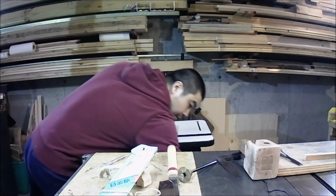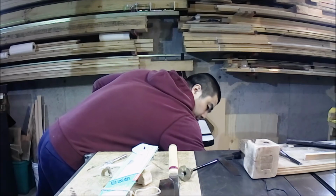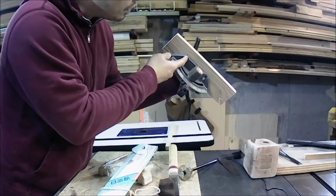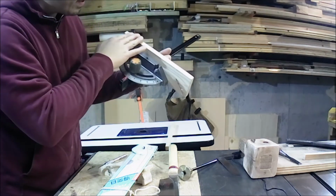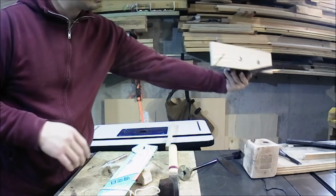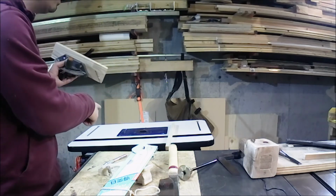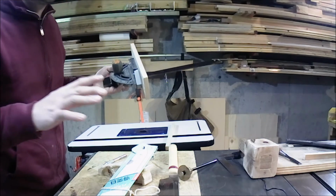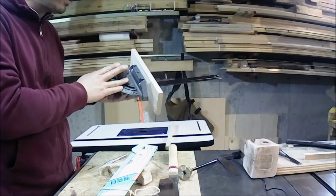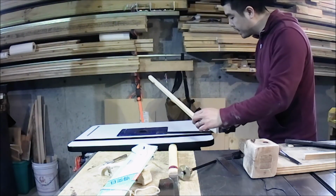And what I suggested to him is, on his miter gauge, there are 2 screws. I have added a piece of block here, not too long, and this is when I was doing cuts on my table saw. This belongs to my table saw. It does not belong to my router table. But the one he showed me he was getting comes with a miter gauge like this. So what I suggested to him is to add one of these things to support his block.